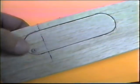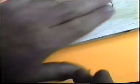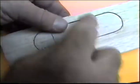Now this little countersink, as soon as I take this screw in and out two or three times, it'll leave its own little impression. I want it to be just even with the surface, and then I'll harden that up with thin CA. And of course, a final sanding over this with a block. Just block sand that in, it'll be just perfect.